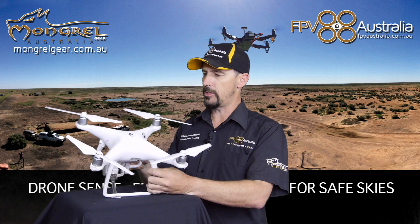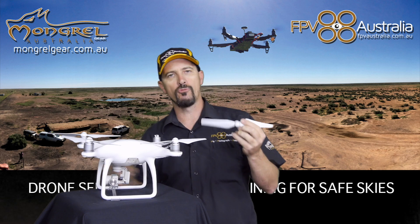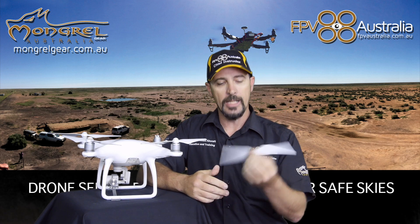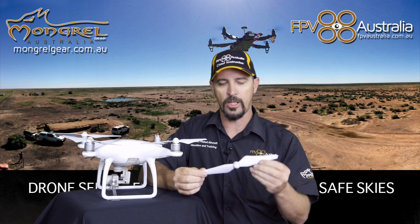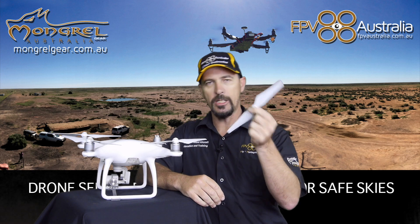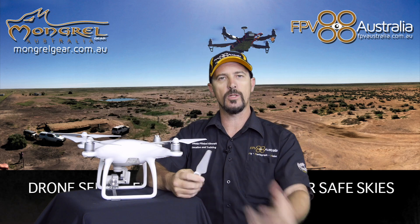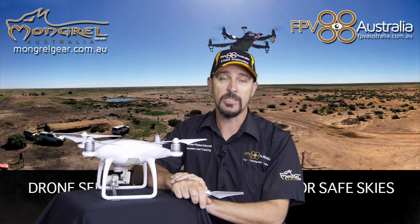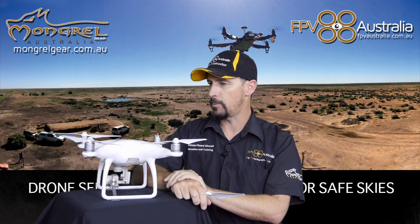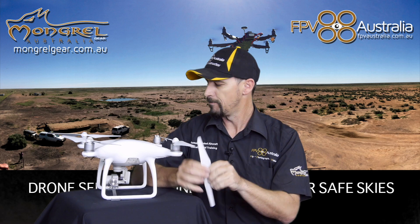So let's look at it. We know that this is the Phantom 4 and it's got four motors, four props, and four ESCs. Let's look at a prop first. You might have heard the term 'rotary wing aircraft' - basically this thing is a wing that rotates, just like on a manned helicopter. It works just like a wing - it forces air downward to make the aircraft fly. These are a fixed pitch, meaning they don't change their pitch in flight, unlike a full-size helicopter where the pilot can change blade pitch to get more or less lift - they call that collective.